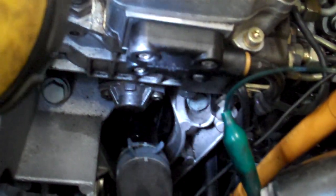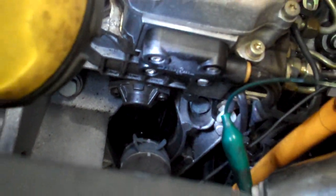Here we are a few minutes later — there's a puddle on the ground from leaky fuel. The pump was still leaking — I shut it off to re-wrap the fuel return line and there's still fuel leaking out of the pump, enough so that it didn't want to start again. All the fuel runs out of the pump, which is one of the reasons we used the lift pump to help it along. Now let's take a look. At the bottom of the injection pump, the leak that tends to make it not run is where the cast iron meets the aluminum. There's a big O-ring down there and it leaks down, usually on those wires and that bolt. And we clearly saw some leaks earlier — now there's nothing.